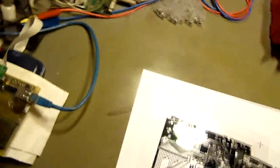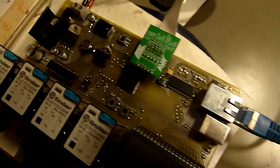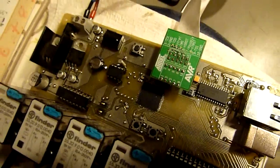The next thing — here this layout I had a real problem with, and it was the footprint of the ATmega; it was distorted. This is clearly the fault of the printer. If a 64-pin footprint is distorted, it takes hours to mount and looks terrible afterwards. So you need a good printer. You also have to configure your printer correctly — use the highest coverage level at least.